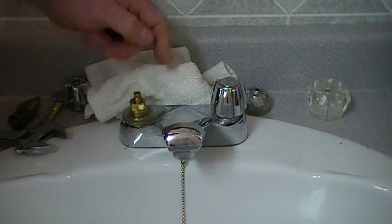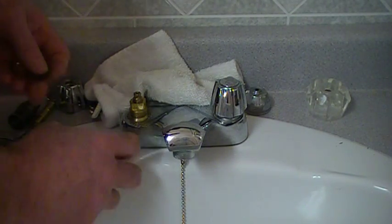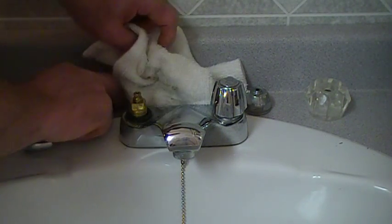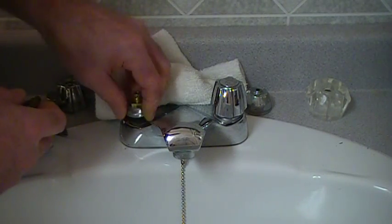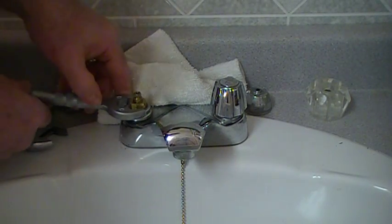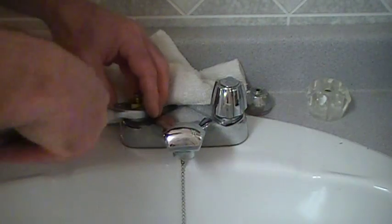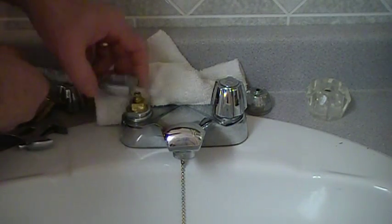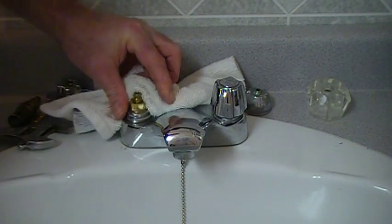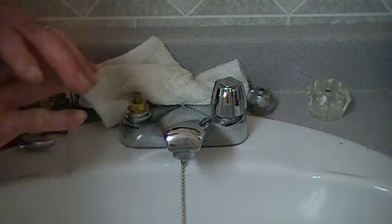When you turn this in, don't over-tighten it. Over-tightening the cartridge will actually bend the brass a little. Same thing when you put your gasket on there — take your packing nut, put it down, same thing, do not over-tighten this. Because you'll find if you do, it will be a little bit harder to turn and you'll be questioning yourself why that happened. If it does, it's just a matter of backing the nut off a little and that should help. It's just a matter of snugging the cartridge down, snugging the nut down — don't over-tighten.